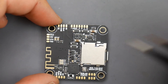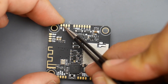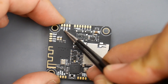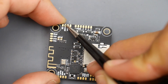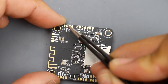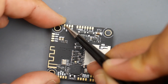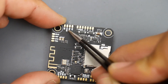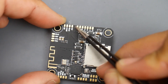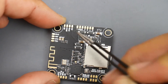Next, the camera is connected up top. We have 5V, ground, and the camera pad. The 5V is the red wire from your camera, ground is the black wire, and the cam pad takes the yellow video wire. There's also an S6 pad here — motor 6 output — which you can reconfigure to control your camera's OSD, letting you change brightness and other settings.